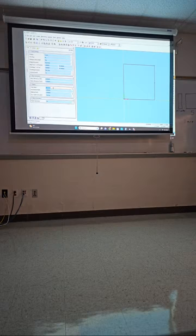This is the thing that we all hate, but we blame the engineers of the software. I know right now you are learning outside with Eric, but if you want to go deep into the part, you go negative number, correct? Yes. Esprit, over here, especially on facing, is the opposite. So it's a positive number, and there is nothing that I can do. Is that clear? Whenever you run in the machine outside, it's a negative number. Over here on the software, it's going to be a positive number.